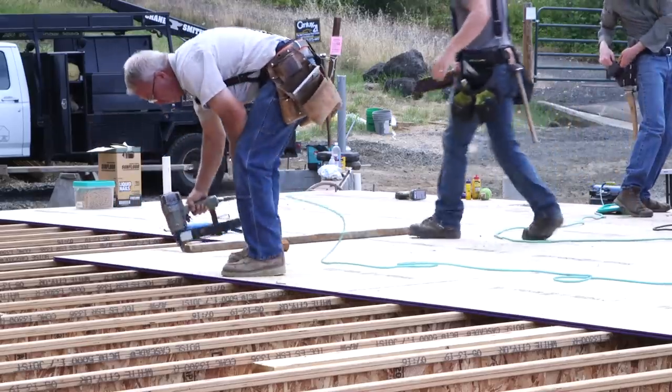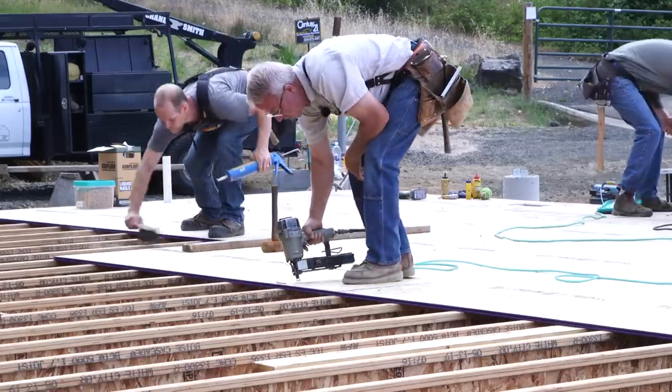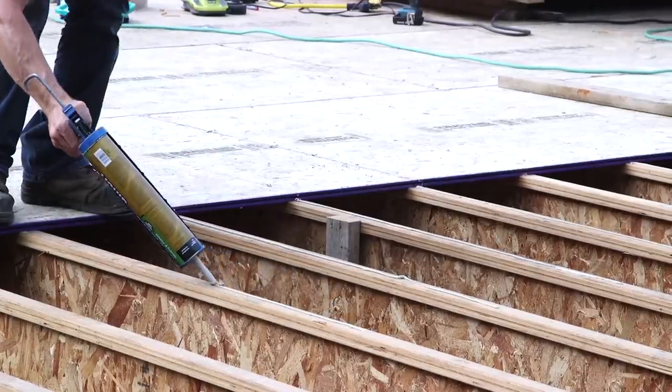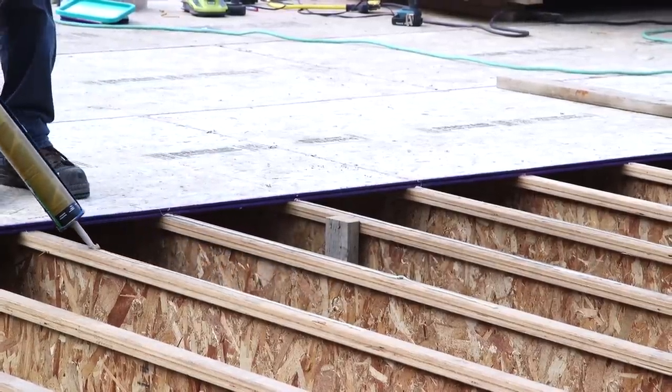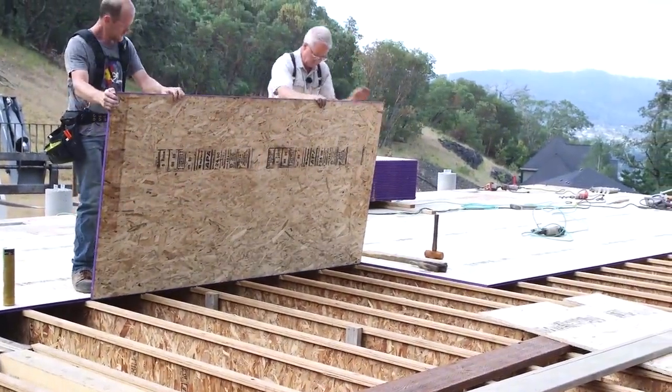These are suitable for use in the exterior on a deck, on composite decking material. That's what was available here, and so we were in a hurry and we bought it. They don't have to be, because you don't mind a little staining in your subfloor, but heck, if you can get them and if the price is the same, why not, right? Because your subfloor, I can guarantee you, at least around here, is gonna get wet a few times before the roof is finally on.